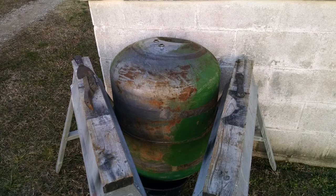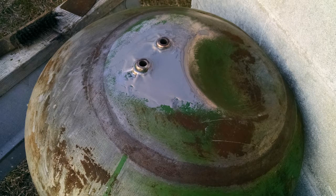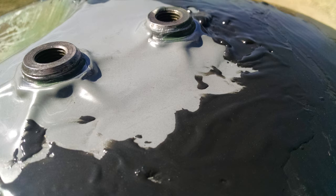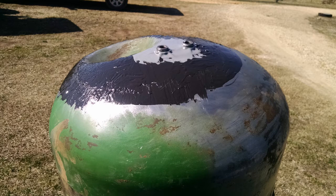Inside the pits, the pitted rust on the tank, there are little pinholes all the way through, several of them, scattered around on this tank in a couple places. To fix the tank, I used JB Weld and just spread it around, covered the entire area, and sanded as well as you can. You can see how I applied the JB Weld, spreading it around and over. It's still working today, working really good.